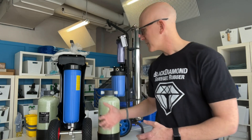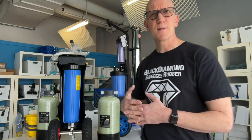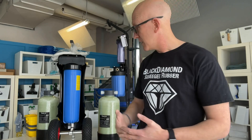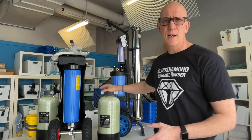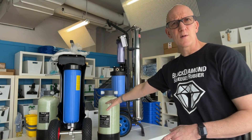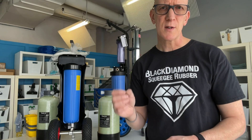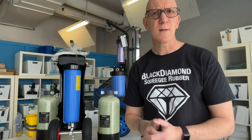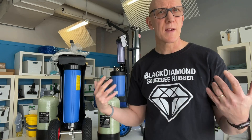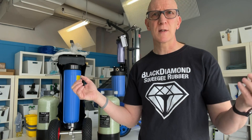I'm quite often asked: what does a better job at purification or cleaning windows — a single stage DI system or a multi-stage system? A lot of people are under the idea that if you're spending more money on multiple filters the water is coming out cleaner, and that's actually not true at all. DI is one of the best forms of water purification. The only issue is it can't do it for a very long time. Imagine this vessel was filled with a million DI resin beads — each one of those beads can only do its job once, and after several days of use the DI is what they refer to as exhausted; it can no longer produce pure water.